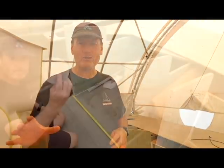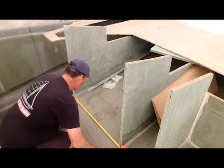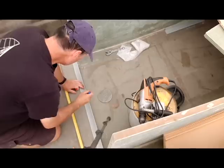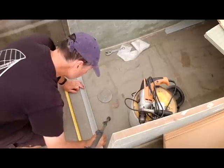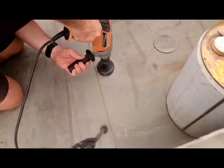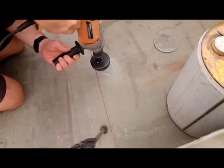I'm going to use a hole saw just like I did with the through holes. I'll make a hole around 100 millimetres wide and core out the 30 millimetres of foam that's laminated into the bridge deck. By coring it I get back to solid glass, and then I can tab the floor and bulkhead together along this line on the front of the boat.